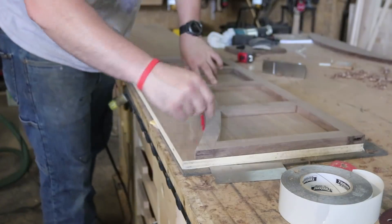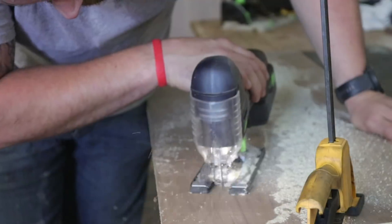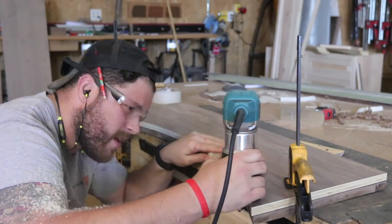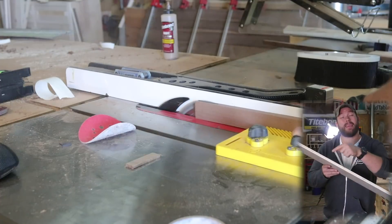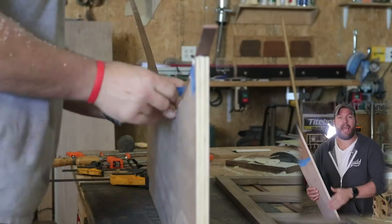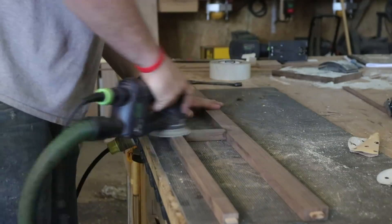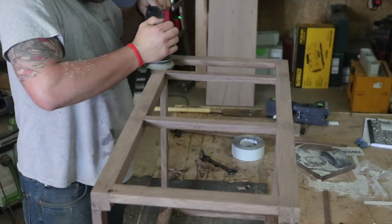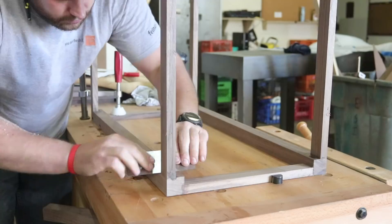I then transfer the bridge panel to the matching front and cut it off with a jigsaw, then clean it up with a router and a template. After cutting this part, I realized there would be an exposed edge of plywood, so I cut a thin strip of hard walnut and edge-banded it in order for it to match. All in all, I wasted about five hours building the curved bridge, which was not included in the final price of the piece, and I ended up losing a little bit of money there.